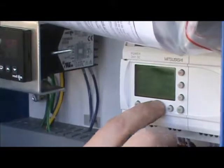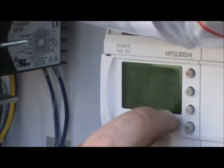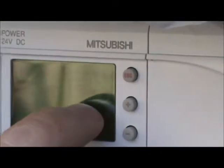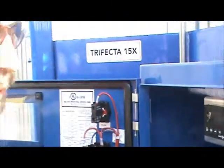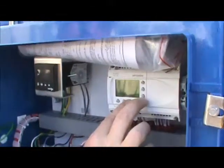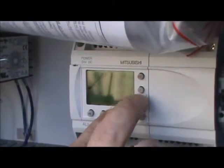Pressing the down arrow will show you the bulk critical set point. The bulk critical set point is set at a default of 150. When one of the tanks starts to fill, if the pressure in the bulk tank is below 150, it will vent to bulk as much as it can and then vent the rest to atmosphere. You can change the bulk critical setting by holding the down arrow and pressing plus or minus.